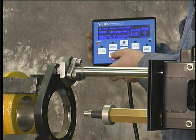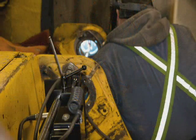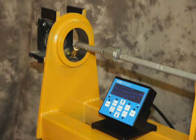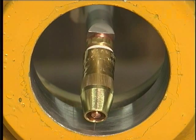The display can be set to imperial or metric measurement. The York bore welder is a full-function MIG system for ID or OD weld buildup, utilizing step technology. Its extensive bore range of one and a half to thirty inches gives this machine more range than any other. The Smart Weld 830 is rated at 250 amps, allowing you to use standard .035 to .045 wire for extended run times.